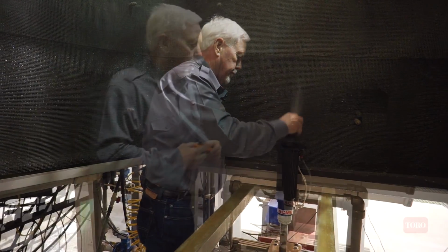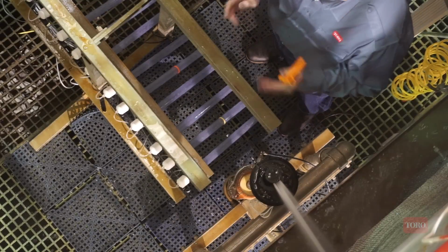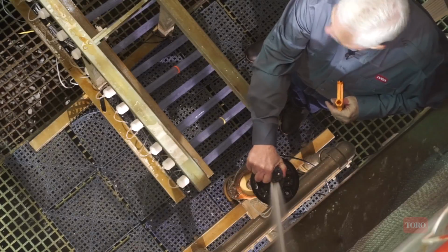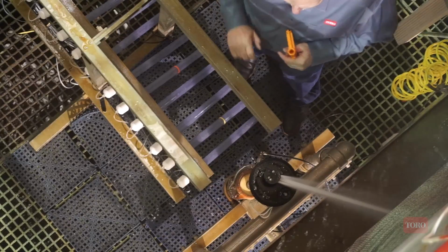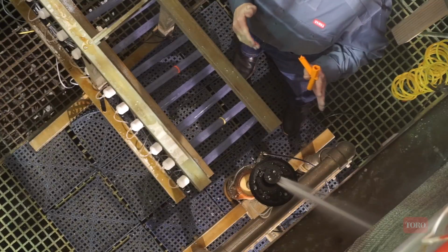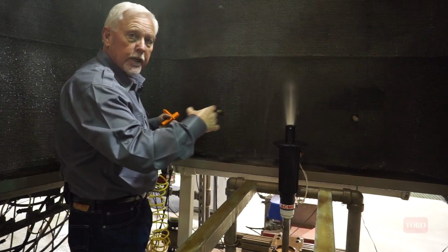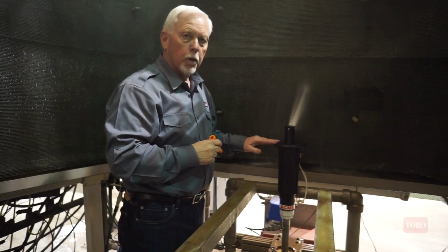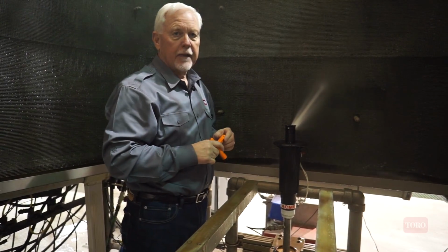All right, to simplify matters, I've turned the sprinkler on so that I could determine what the arc setting was right now. And so there's my right stop position, and there's my left stop position. Now, if that left stop is not where I intended it to be, if I wanted to move it over like I did by ratcheting the Toro riser, again, I physically have to disassemble the sprinkler and change the position of the riser inside the body.